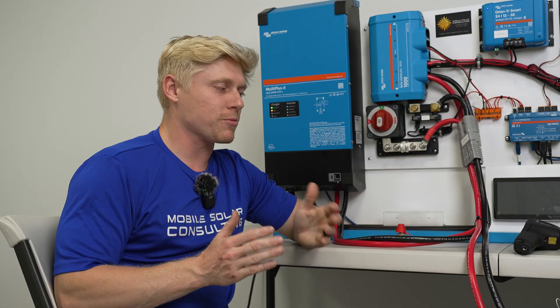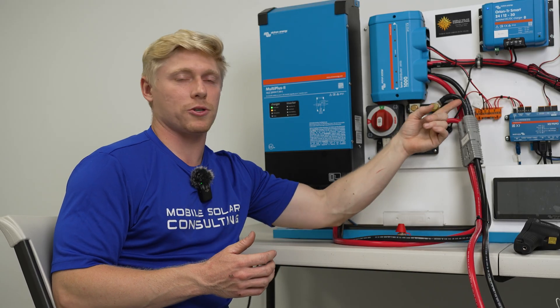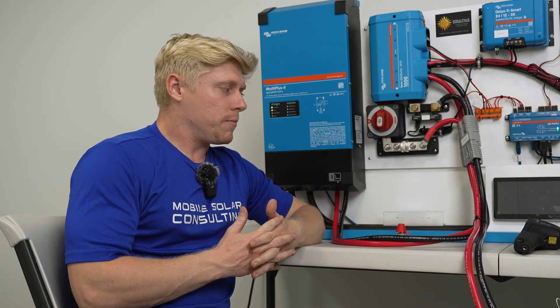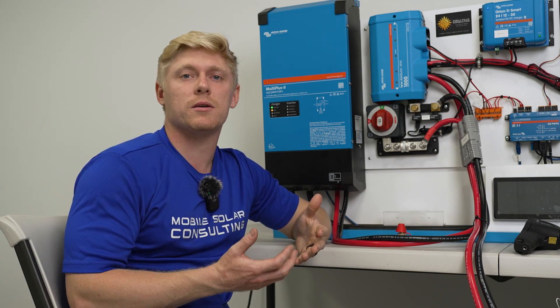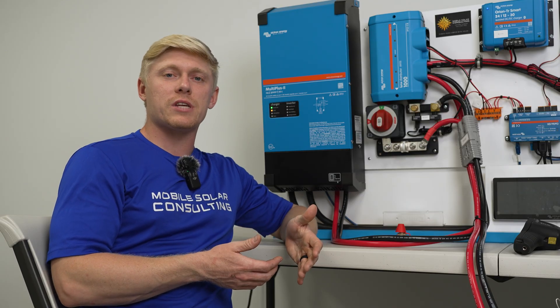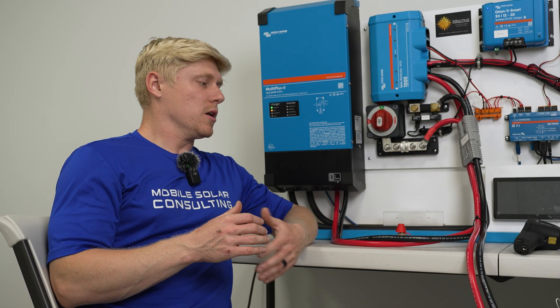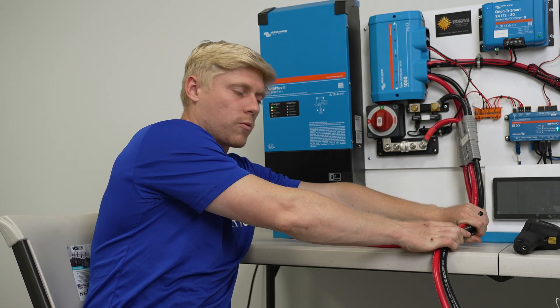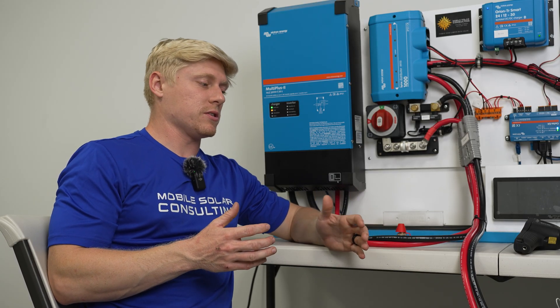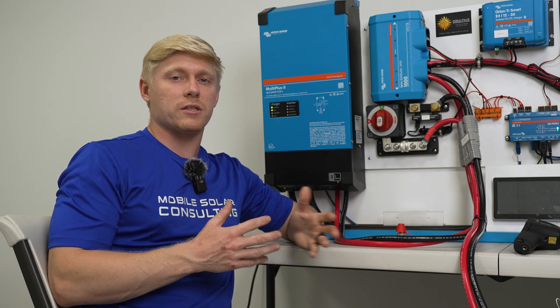The purpose of any fuse is really to protect your wires. The fuse is not there to protect your charge controller or your inverter — it's to protect your wires and to keep the insulation from melting and burning. A lot of people will size fuses in different ways. We basically size them for what ABYC tells us. Blue Sea Systems has a really helpful chart, linked in the description, which explains the maximum allowable fuse size given the conditions the wire is installed in. If your wire is in an engine room or in a tight bundle, they require a smaller fuse size, but they allow more current if it's installed in free air.